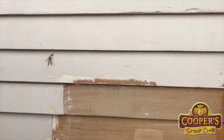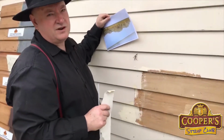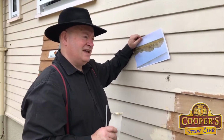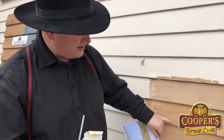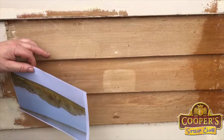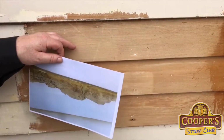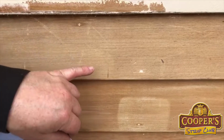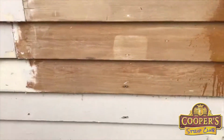One, they bring out vapors from the paint itself, and so you're breathing up all that vapor, again lead. And you're also bringing out oil, because this timber is, I think, Rimu. Totara is by far the worst. Oil that's natural in the timber comes to the surface when you're heating it or sanding it, and then when your new paint goes on, unless you've got some magic primer, you're looking for trouble.